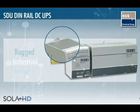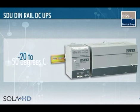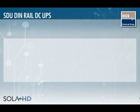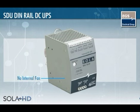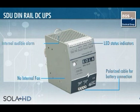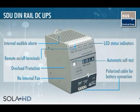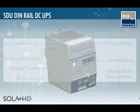The Sola DC UPS has a rugged industrial grade design with a wide operating temperature range from minus 20 to plus 50 degrees Celsius. There's no internal fan and no external cooling is required. Power modules include a polarized cable for quick connection to the battery. It also features LED status indicators for easy visual diagnostics, an internal audible alarm, and an automatic self-test to check UPS and battery functions. The overload protection in normal and battery modes prevents damage to the power module and batteries, and the remote on-off terminals enable diagnostics and control from a distance.